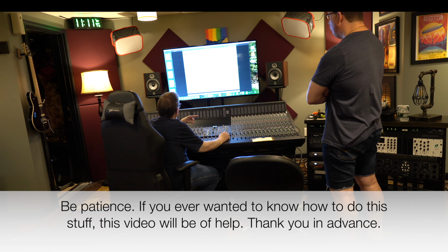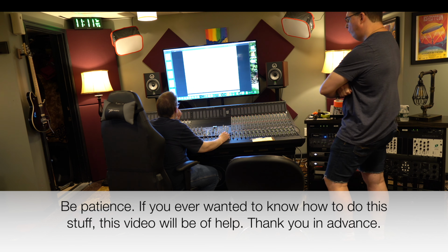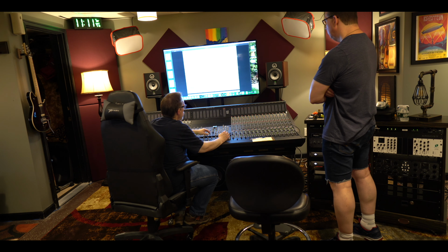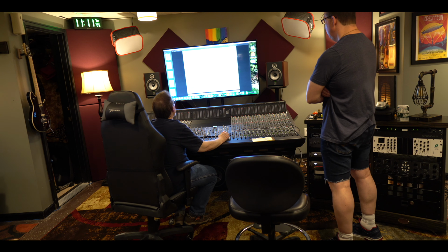Right. And that's why in the console software we're seeing four channels of audio. And we're also seeing the fact that that one set was not reacting to the fader, because that's a send point. That's a send pre-fade point. Right. So that's why that's not reacting to the fader.